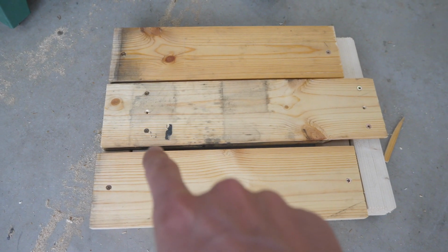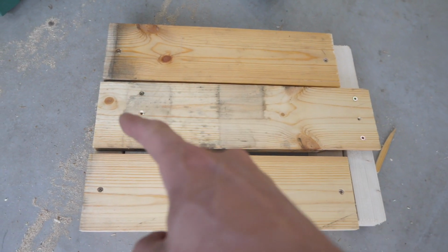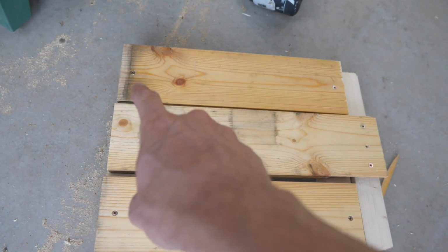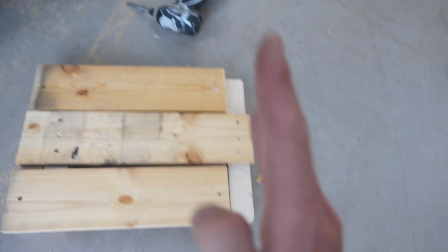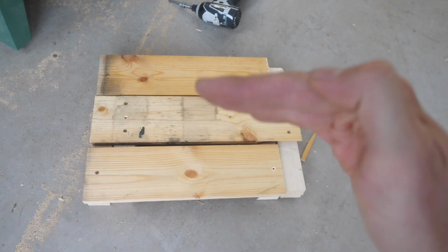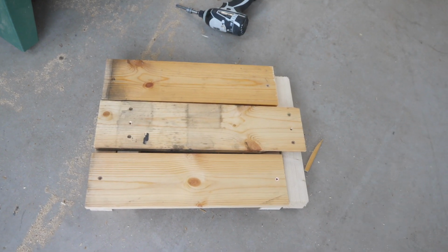Another point from this angle is that the pulling out part I've built here has longer slats, because the tail end is resting on the beam that the fixed ones are supported by. If you're looking at it from a side angle, you've got the legs that go down to the floor and the slats on top, so you've basically got a right angle. If the back end doesn't rest on the back part of the bed, the right angle just rotates, so all of these slats fall away and it ends up flopping around.